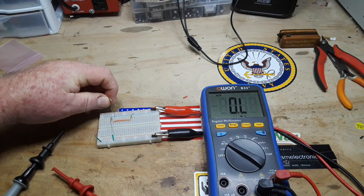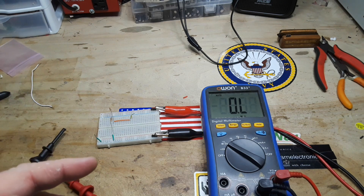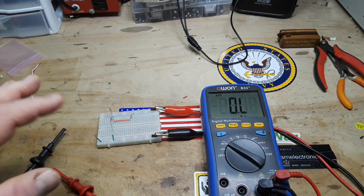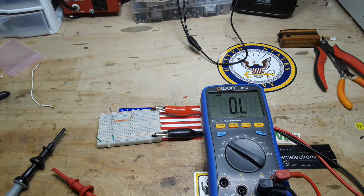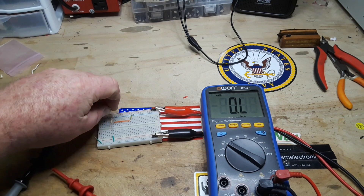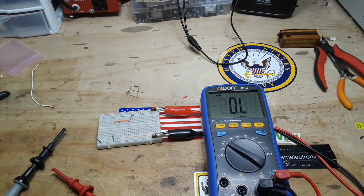0.974 — we'll put that back in the circuit. And the top resistor reads 0.974 as well. They're matched, and they're very close to being exactly 1k but they're not. So what we have learned is that these two matching resistors produce half the voltage at the junction. Is that the case for any two resistors? Well, let's see.